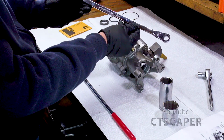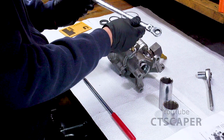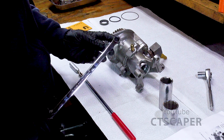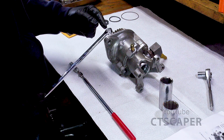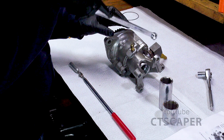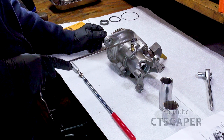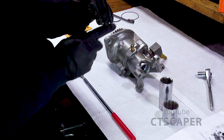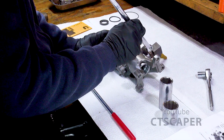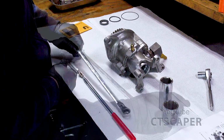This is my gear wrench, 120 XP. I love these things for tough spots. It's a ratcheting wrench and it's really long. But these are what's known as spline drive. There's little nubs that come out and they grab the bolt, so they tend to screw up the bolt, for lack of a better term, if it doesn't want to move. So because I was having trouble, the spline drive did screw one of the bolts up.